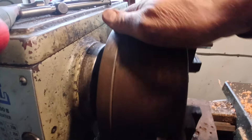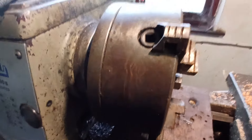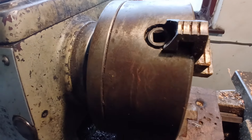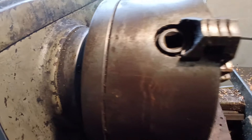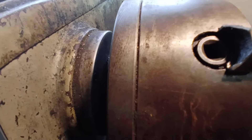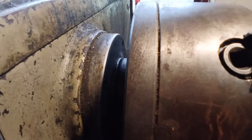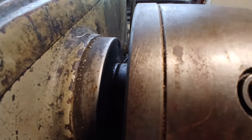So it's now loose and I can take it off. Some people put grease or oil on the thread at the joint, but I find that only makes it tighten up more. What you gain one way by having lubrication for taking it off, you lose because the chuck tightens even more since there's no resistance to it spinning.